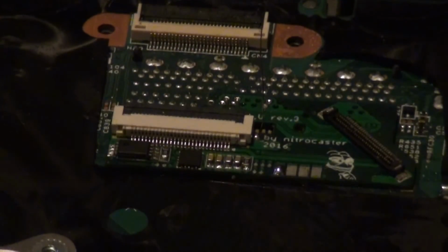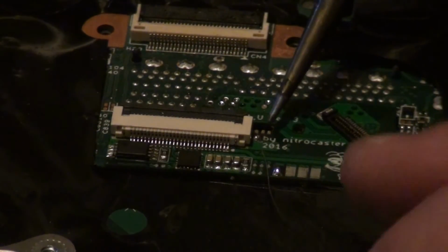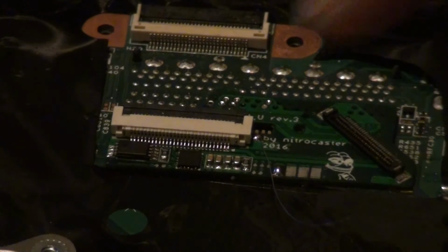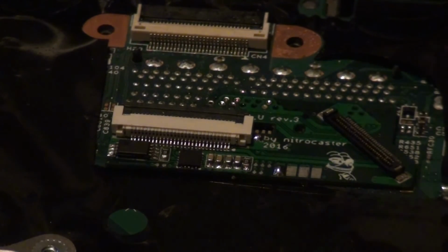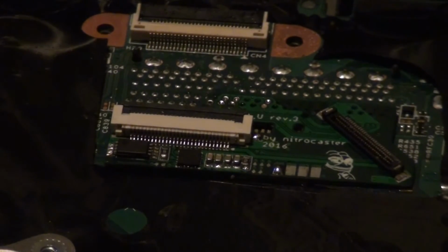So to finish the sense wire, you just bring it down, and usually you'd have to apply solder to that pad beforehand. It's already done. So I can move my hands out of the way and just bake it there, and just whip out the cable. Got the rest of the board moving. Yeah. So the sense wire should be done. Now let's see if you can still see the other connectors I'm about to do. Yeah, that's about right.